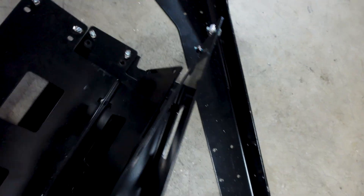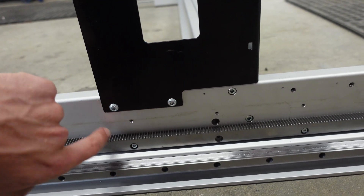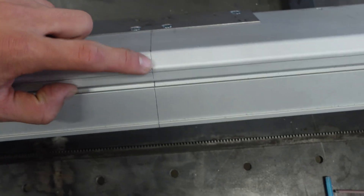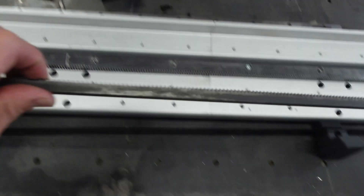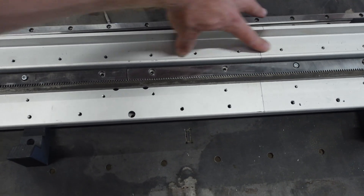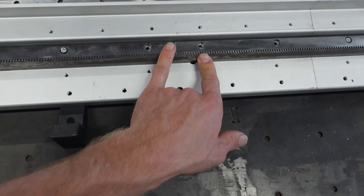So all the legs fell over — I had them leaning against the toolbox; I should have just dropped them on the ground from the get-go. Just taking off the top of the flange. Reason being, the pinion will be able to move by and not hit that. What I figured out is it's going to be best if we have a theoretical small gap here, such that this plate isn't pulling these two rails together. The true position is determined by something much shorter. That puts the position of where the two rails are with respect to each other. There would hopefully be little to just about zero gap in the linear rail, and that's going to be determined through the true position of the rack teeth. The rack teeth is the datum in this sense.